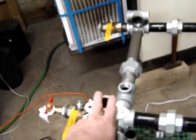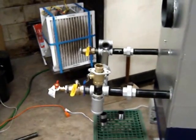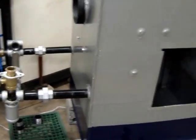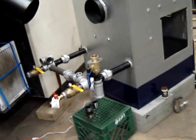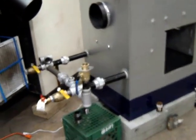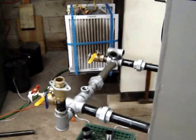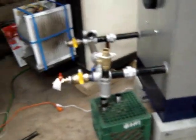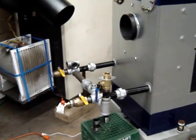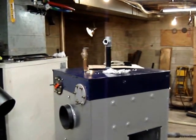The pump is going to go here for the heating system, and the returns will have zone valves in them. I've got to start putting this stuff together with some tape and sealer and hopefully it will all go. Once this part is done it'll be fairly easy to do the rest. The only other pipe matching part will be the boiler bypass — it'll come off that T in the top of the supply and come down to this T right here. That'll have a valve and at least one, possibly two unions in it. If we can get that done today, we can probably start running the supply and return over to near the heat exchanger, then do the PEX to it.